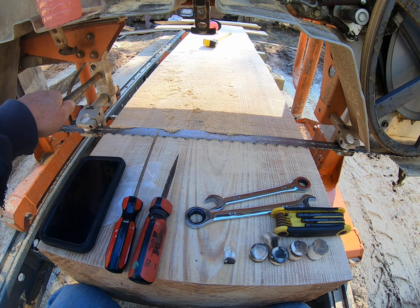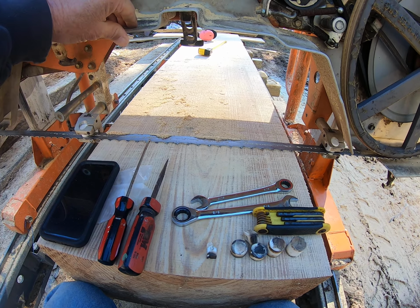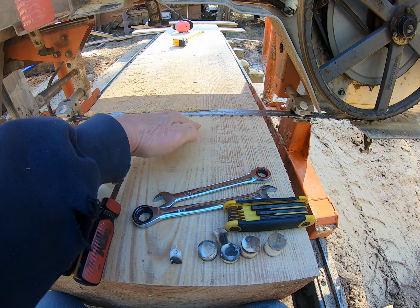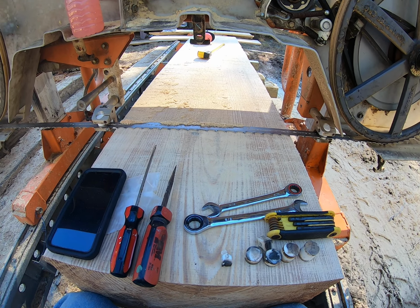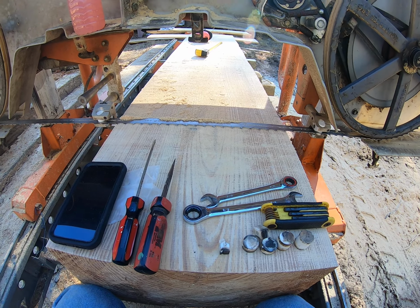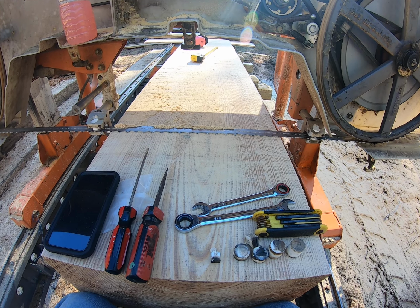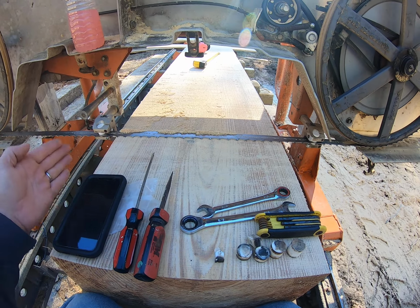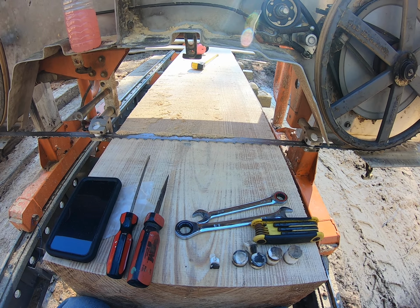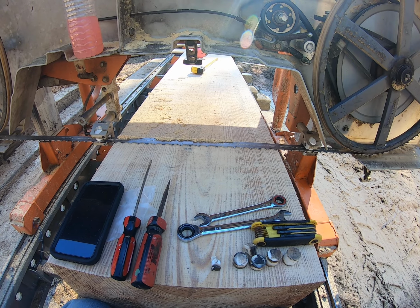When that blade, when I sharpened or a new one, when I pull this back, I'm watching that sawdust, and it should clean that sawdust off, and there should not be any waves in it. If it gets to where there's waves, I take the blade off. I start the day most of the time with, say, maybe 3 blades. One that was left over from yesterday, and what I do is I'll square the sides up with that. Then I'll take it off, the first log anyway. I'll take it off and I'll put on a sharp one I sharpened, or a brand new one, or whatever.